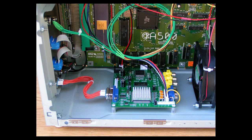The only problem with this board is that the main chip that has the aluminum heatsink mounted on it gets very hot. It gets so hot that I think the chip will not last very long. The heat will greatly lower the life expectancy of that chip. Also, the chip gets so hot that it produces artifacting or noise in your video output. You can see it on the Amiga screen, or on your TV or whatever.